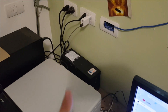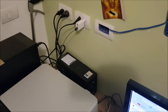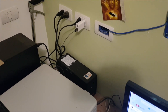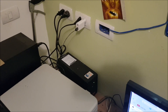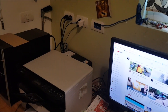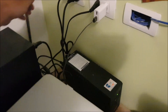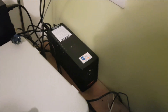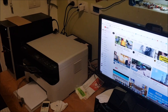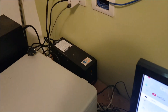Here in my office I have my UPS which I have rebuilt from lead acid battery to lithium ion phosphate cells. I am going to deplete the pack now to show you a problem which you might have when you do this and how I fixed the problem. So let's take the power off. The UPS is now running the PC still. I will slowly shut down the PC and then just wait until the battery pack is fully drained.